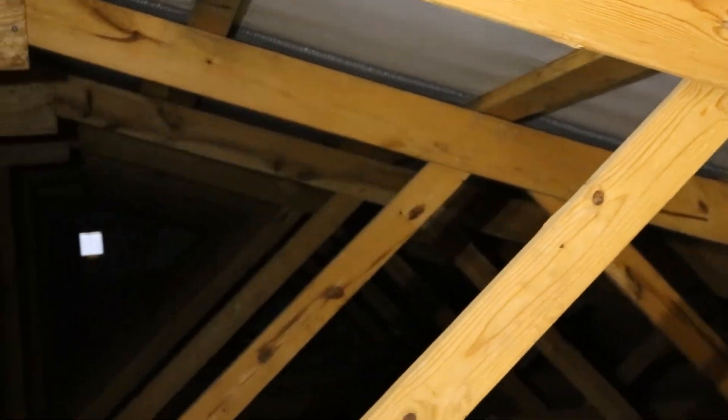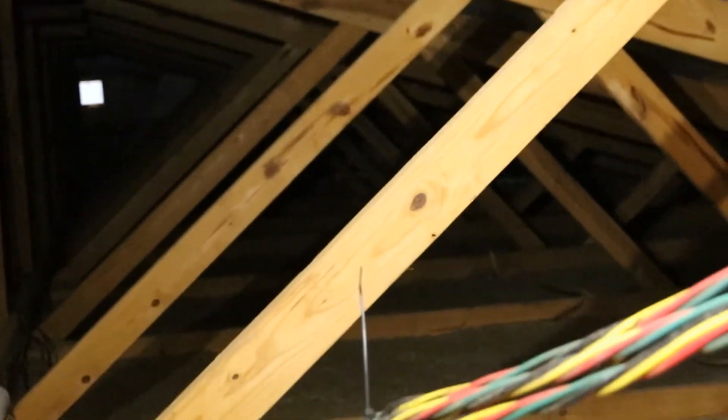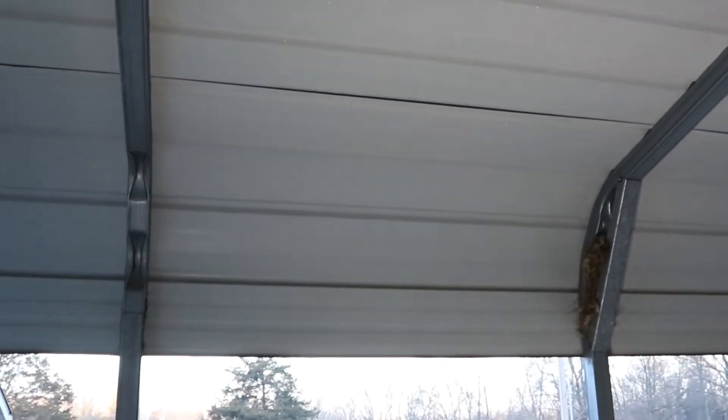That moisture is not transposing itself to the inside of the building and allowing all the insulation and things to get wet. Let's see if I can give you a view of the frost setting up underneath this carport. A moisture barrier doesn't stop the frost from getting on the metal, but once it starts melting, the moisture barrier will simply run the water right down the side and off the edge of the building, so everything underneath here is staying dry.